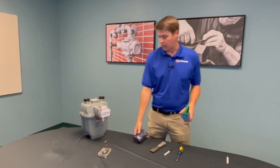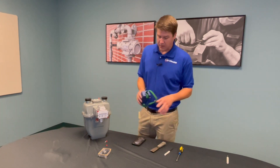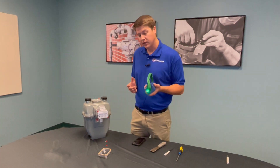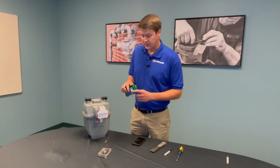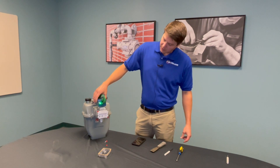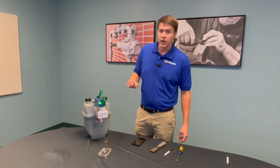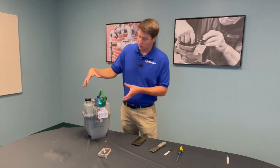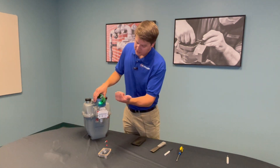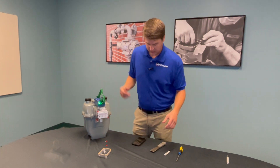Our next step is to activate this smart point out of factory sleep mode. Proper command link placement is important — make sure the command link is on, indicated by the green power light. For the 100GM smart point as well as the 300GM smart point, and all residential smart points, place the command link with the power button facing towards you, sitting on top of the meter.